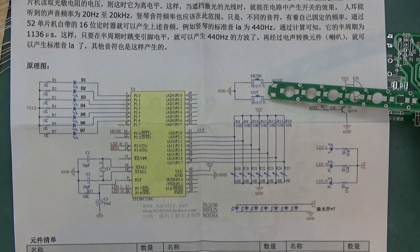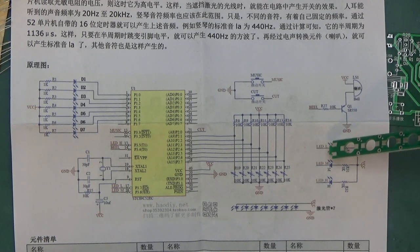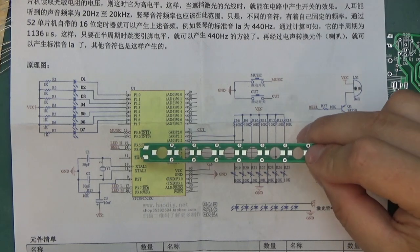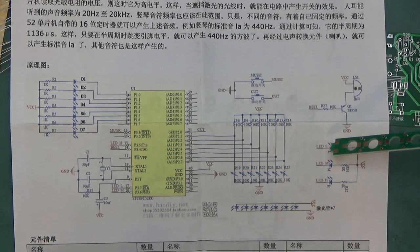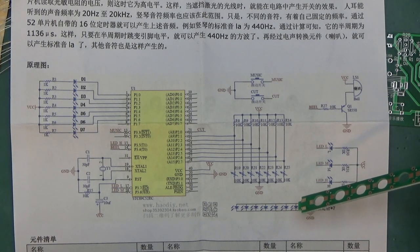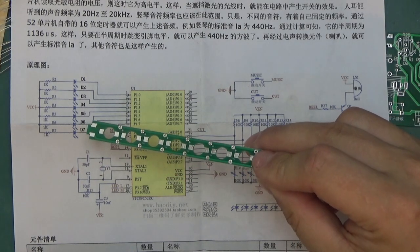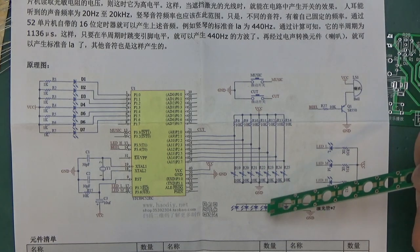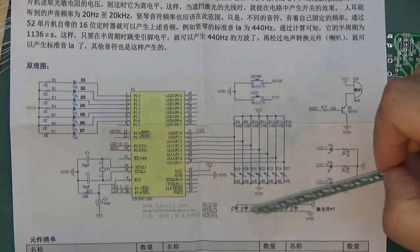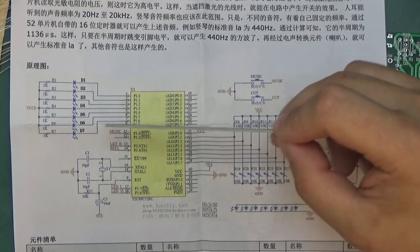Two switches, I'm quite sure I've seen only one. So there is music and cut. LEDs for indication L, M and H. So those get connected to the microcontroller as well into port 3. It would be reasonable to assume that it's a low, medium, high of something. Seven light emitting diodes again. So those could be the lasers, and those will be just the regular diodes. Those little laser modules have got an internal resistor incorporated into the casing, so they will be constantly on, and those will be little LEDs which will presumably blink when we play music.